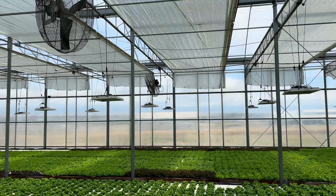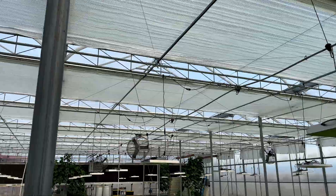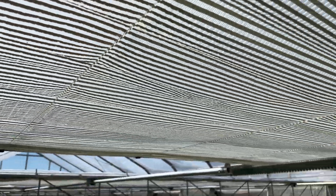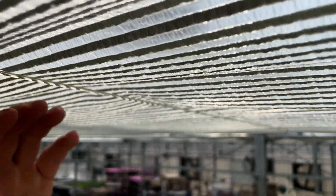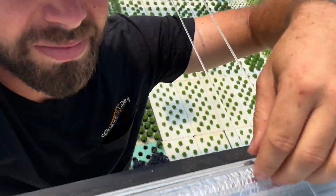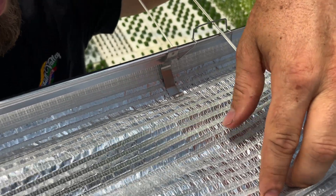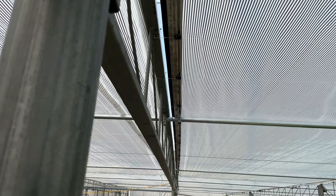The system is divided into 12-foot sections and the shade cloth rides on these — it's like fishing string, nylon or poly string. That has about a 10-year lifespan, so that's a lot of string to replace every 10 years, but it needs to happen. The shade cloth is attached to the aluminum profile with these little steel clips. It's a really good system, and then the aluminum profile seals up against the truss.